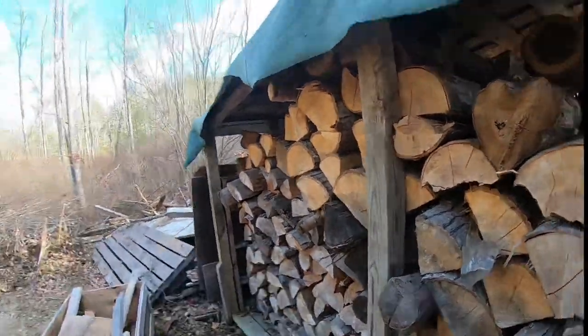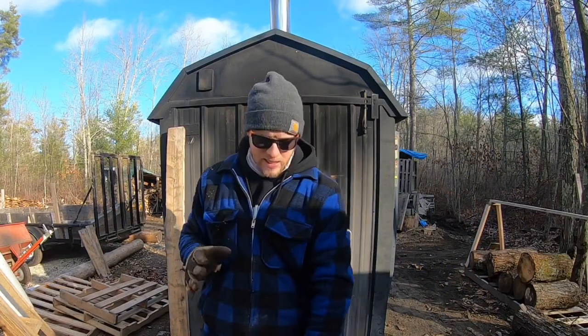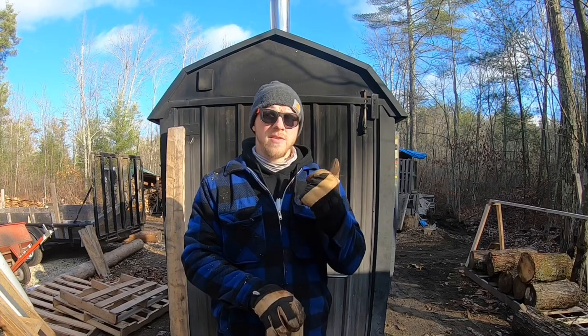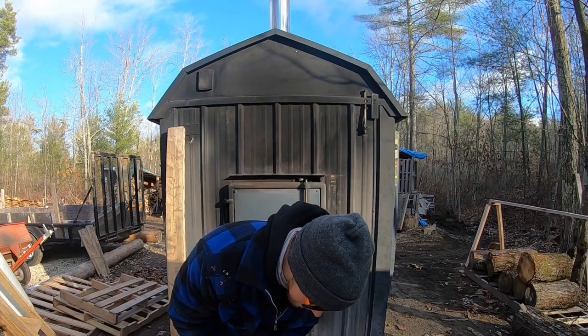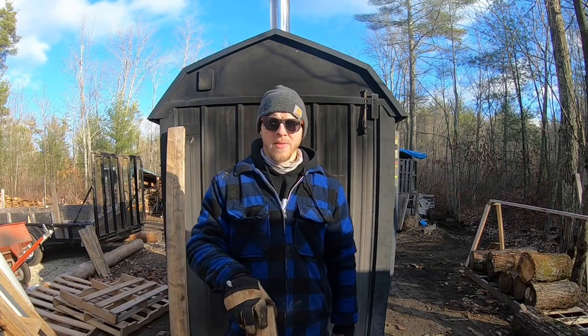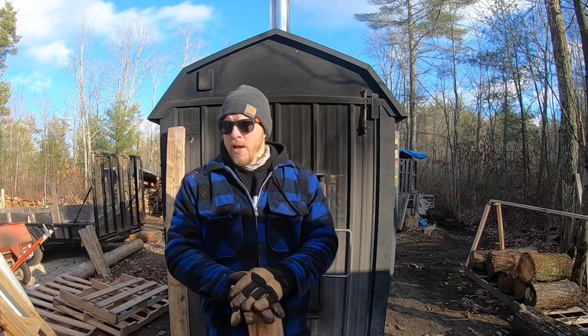Most of this is split — if I need to rebuild my coal bed, I come over to this shed and grab some split rounds. I know which logs are seasoned and what's not. Split wood is easier to handle, it's lighter, it dries quicker — but you're using more of it. This piece of split wood could burn in an hour and be gone. This big 24-inch round by seven inches? That would burn for a whole day if not longer in this machine.